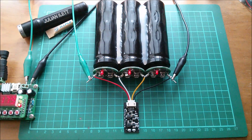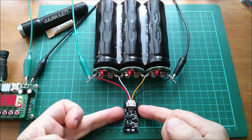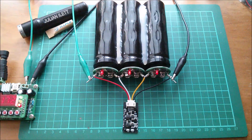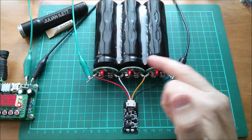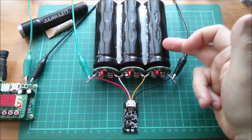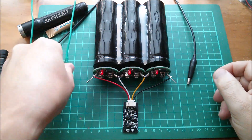Good morning all. I'm charging supercapacitors again because it's fun. I've got a little addition to my supercapacitor block: a little three-cell active balancer. These supercapacitors are fully charged - I've got a holding current of 170 milliamps, the three lights are on the protection circuits so they're all at 2.5 volts each. These are 2.5 volt, not 2.7 volt supercaps. Let's turn this off, disconnect the connecting wires, and have a closer look.